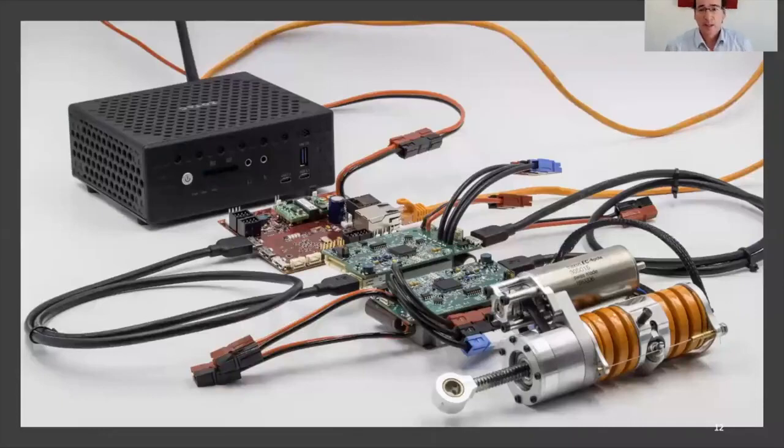Aptronic systems have since been based on EtherCAT communications to handle the data streams required by SEAs. EtherCAT is a great protocol, but it's not for the faint-hearted, because it's much more elaborate and difficult to master compared to other protocols like CAN bus. Of course, CAN bus is very limited on bandwidth, but if you're going to incorporate EtherCAT into your lab, you will need to spend significant time on it.